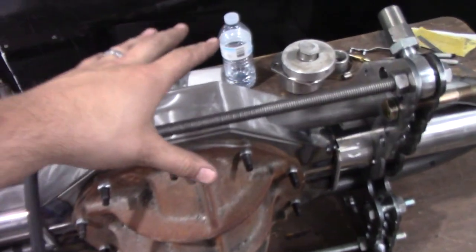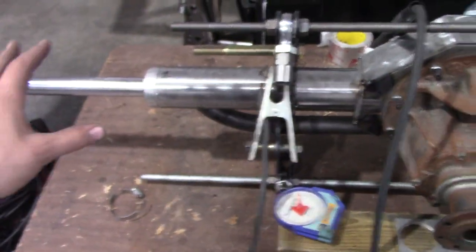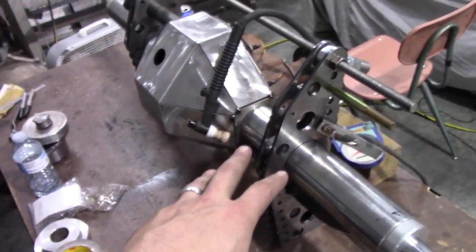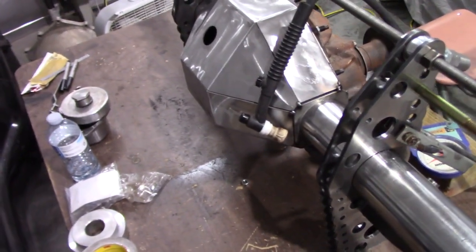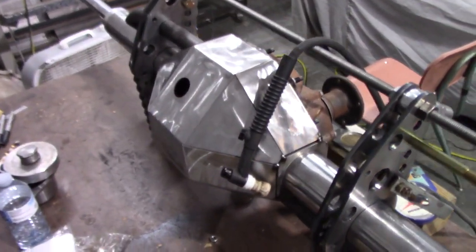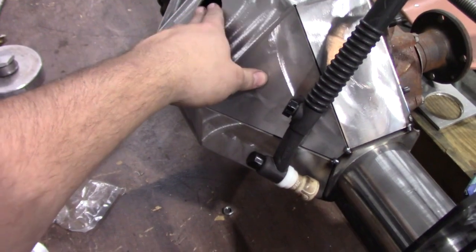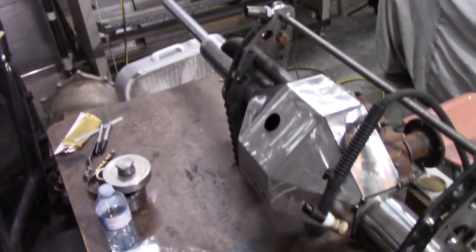This is our project for today and we've got a ton of welding to do. In this video I'm just going to show the welding — not all the measuring. You can see our KCD brackets on there. You guys can buy any of our bracketry — both front and rear suspension components — on our website. This will be something we'll be offering in the future for our extreme series rear ends. Our brackets here have four-link holes, shock mounts, anti-roll mount, a fill hole, and a drain plug in the bottom. We're going to get some welding done on this bad boy.